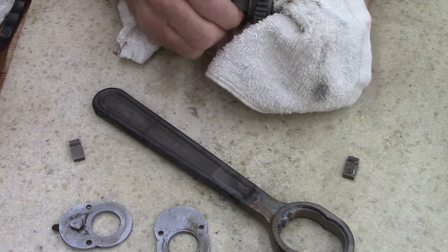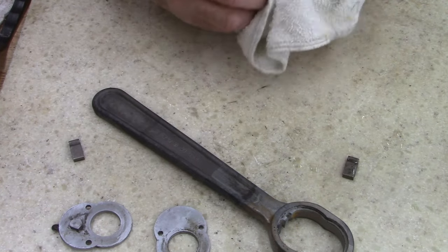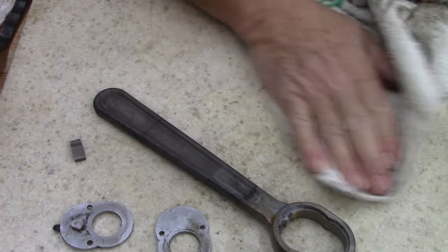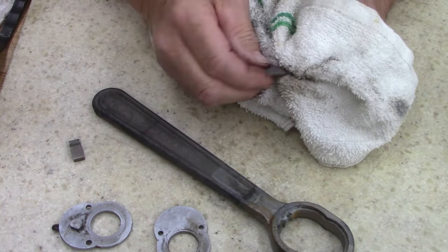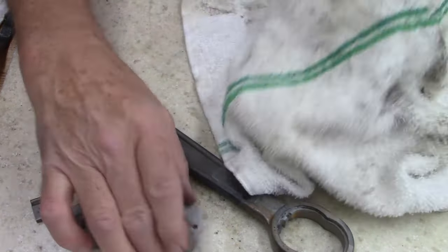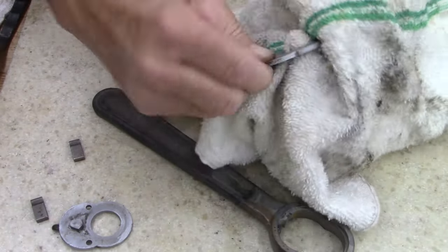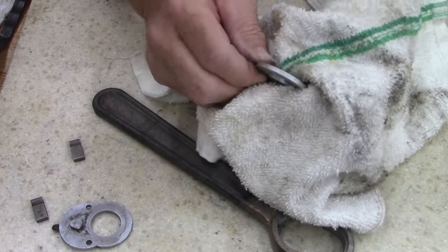And then later on, when you get your own vehicle, you don't, because I bought my first vehicle when I was 15. I bought a 49 Ford pickup, always working on that thing. Single barrel Holley carburetor. That thing, always, always working on that thing. 6 volts. If you've never done it before, you explode a 6-volt battery with the 12-volt charger. Well, I've done it. That sucked. Don't know how I didn't lose my vision on that. But I learned really quick that a 12-volt charger doesn't work on a 6-volt battery.